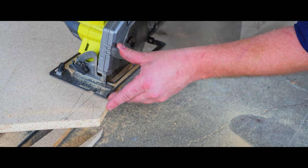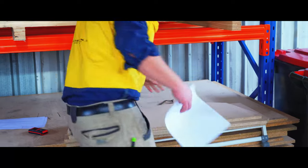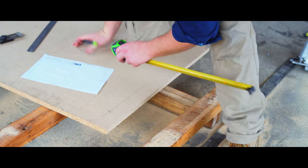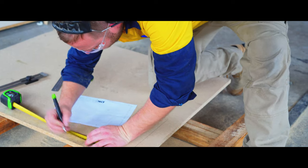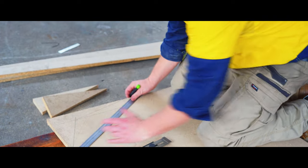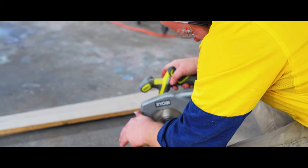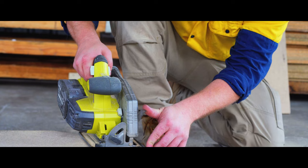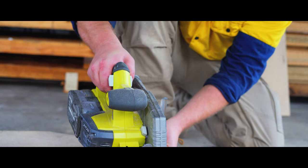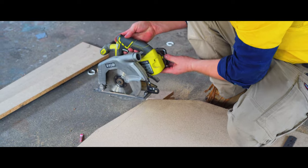So, talking more about the fixtures inside the vehicle, we had to design this double dog cage around mounting points inside the vehicle, making sure that there was a flat platform inside the back of the vehicle so that this dog cage would sit flush and level. We had to make sure that there were no fixtures inside the vehicle that would foul. There are a lot of trims inside the vehicle that have radius bottoms, radius tops or radius sides, which can make it a little bit hard to butt square or flat joints directly up to. So making sure that everything is notched out correctly and faceted correctly, it fits in and doesn't foul on anything at all.